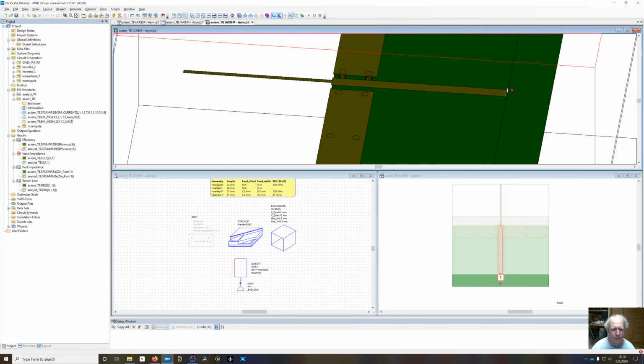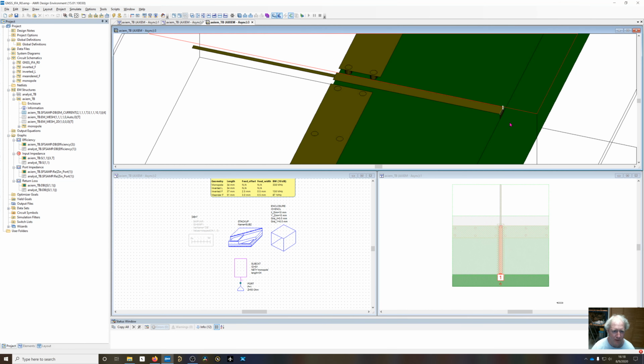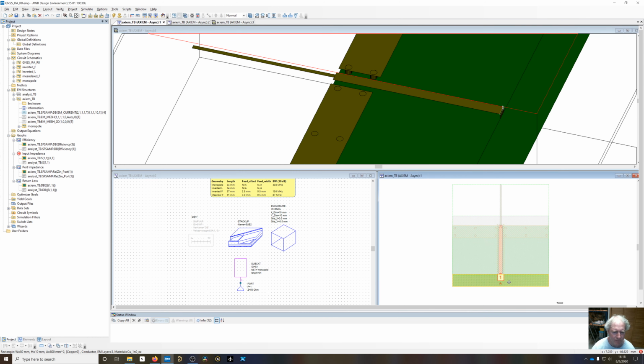And in order to do that properly, we need to add some ground plane on the backside, a few substrate lengths away, to take care of the currents that may be at the outer edge of this port. And I've done that. And that's the advantage of the EM structure. You can bring your circuit in, and you can add on extra stuff as needed.